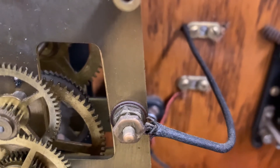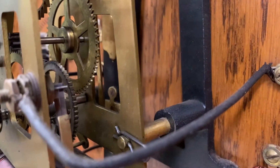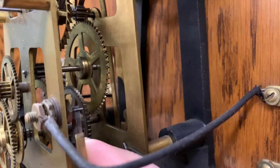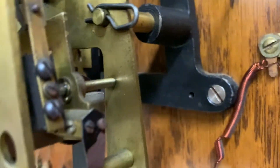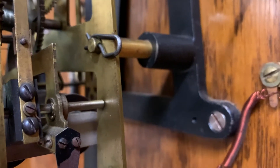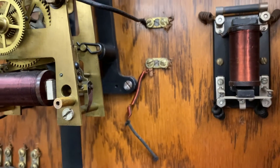This may look like it's electrically connected to the clock frame but it actually isn't — you can see those are some insulating washers there. Tracing where this wire goes, a contact on the opposite side of the winding solenoid connects this screw to this lever here. On this lever you can see three screws, and the one in the middle has a little hanging piece of wire on it, which I believe is the other end. So I'm going to reattach that and we'll give it a try.